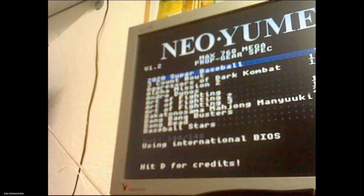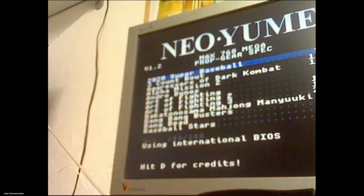He seems to be thinking two cogs could ping pong between two shared line buffers. The way you normally do it is you don't have two cogs alternating scanning out the lines, because that causes headaches. What you normally do is have one that scans all the lines out and one that generates them all the time. Obviously that's better, because now you have two separate domains of code. You can not only separate them more easily, but you also just have more cog RAM in general.